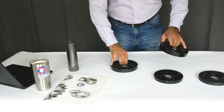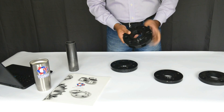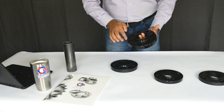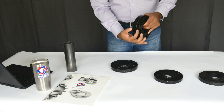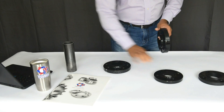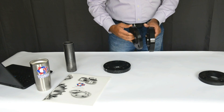Same thing if you jump from 300 to 600-pound flange — again, this is for a 2-inch. You can see this portion stays the same, but the outer diameter is slightly bigger, the bolt circle is slightly bigger, and it's a thicker flange. If you compare it with the 300-pound, or with the 150-pound, you can see the 600-pound is much thicker.